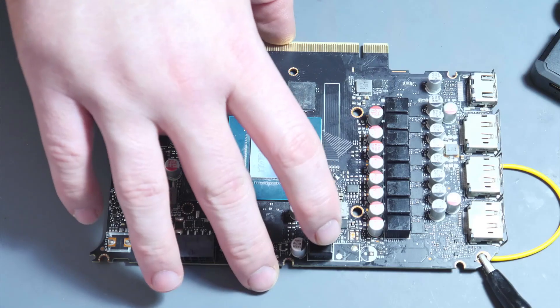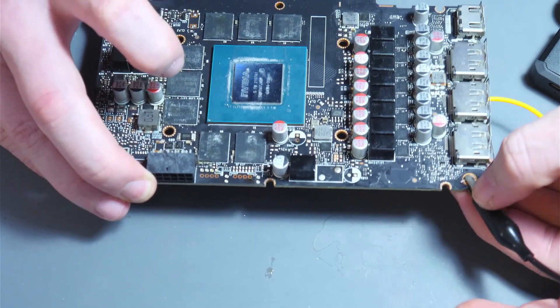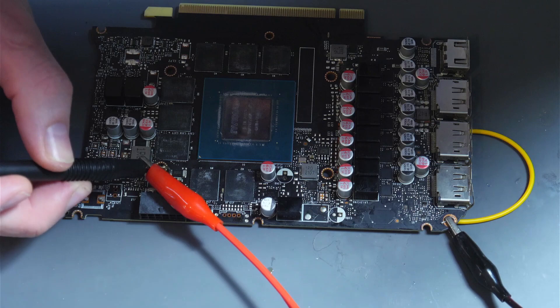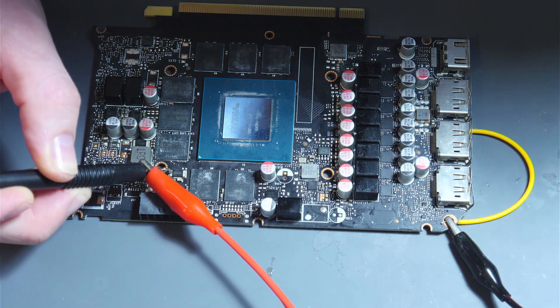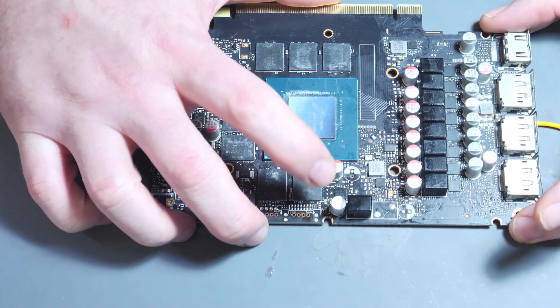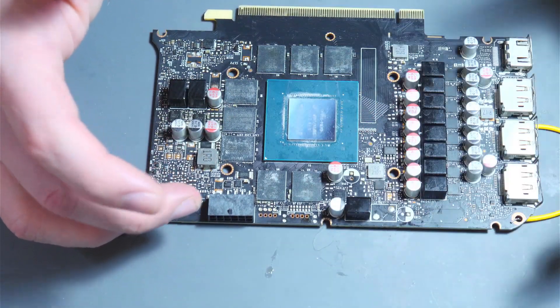We have the wire soldered on and clamped to ground. This is the lead from our voltage injection tool — just a bench power supply. It's set to 2 volts and we're putting voltage back down this rail to see if anything gets warm. Injecting now — the power supply is pulling 5 amps and we can see something getting warm. It's subtle but it's enough. According to our thermal camera, the top phase is the one which is a problem. So we're going to remove those two capacitors just to be safe, remove the power stage, and see if the short clears.